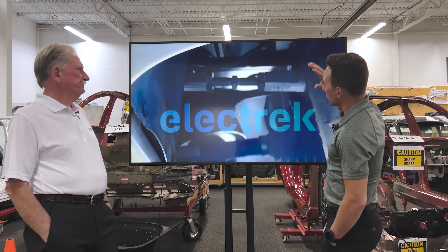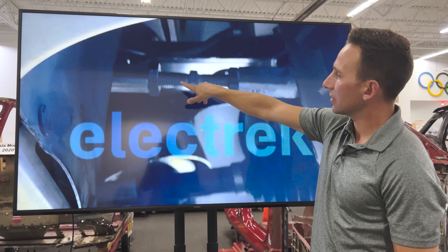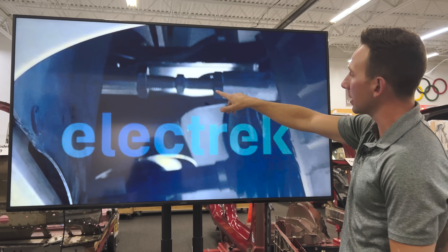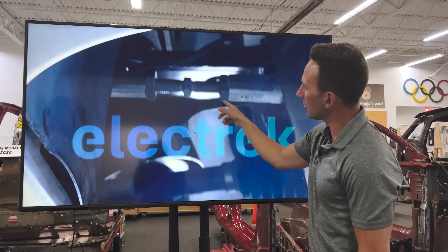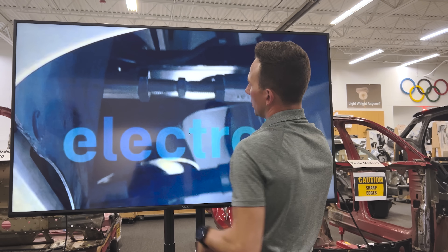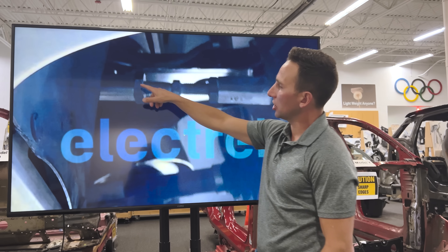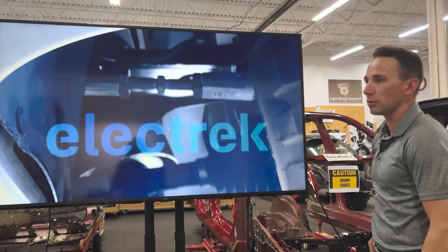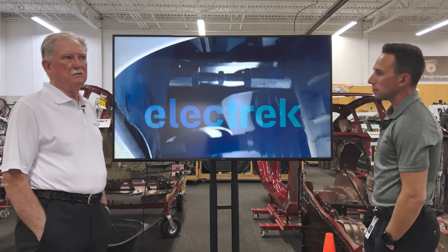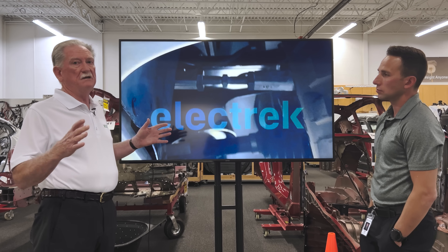This photo looks like it's at the rear suspension, and this is either a camber link or a toe link — more specifically, it's probably the rear tie rod. When we talk about the rear steering system, this is likely the rear tie rod. You've got jam nuts on either side, and in the center as you rotate one direction it'll bring these two closer, rotate it the other direction it'll separate them out. As you're aligning or want different properties from your suspension geometries, this is going to help with that. Once you get it where you want it, cinch those jam nuts down and they're not going anywhere. The unique thing about this type of product is it's got right and left-hand threads — one side is a normal thread, the other is a left-hand thread, and that's what makes it go in and out when you crank the center.